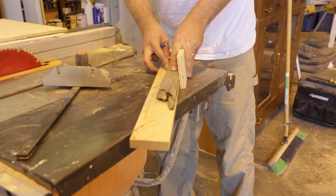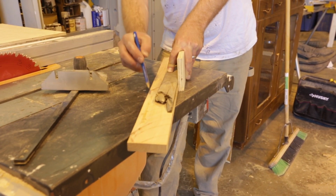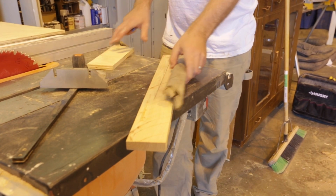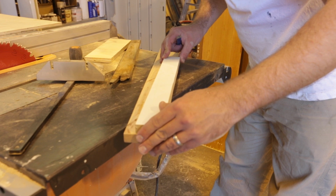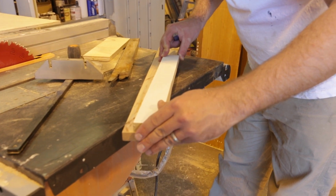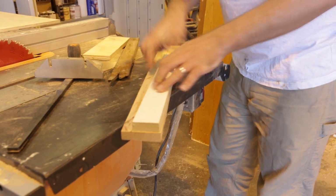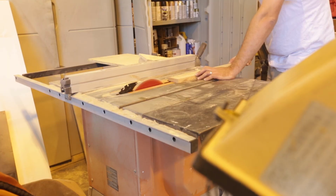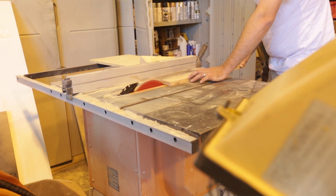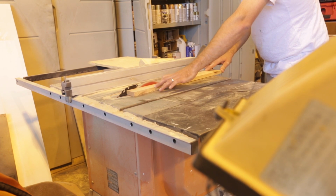Obviously, we want our new slat to follow the same angles. So what we did was line up one edge of the slat we had against the edge of our 2x4 and draw a line on the other side. That gave us the angle going up that piece of wood. Then we used another straight piece of wood, or you could use a ruler instead, to draw the rest of that line. Then we used the table saw again to cut carefully along the line we just drew.